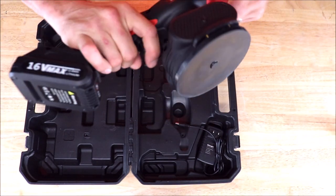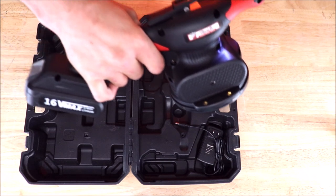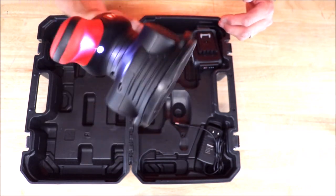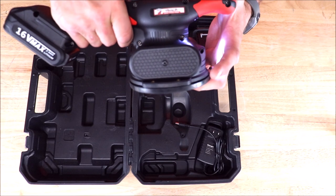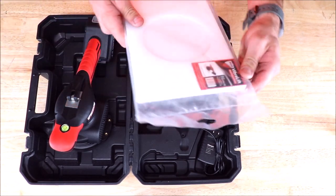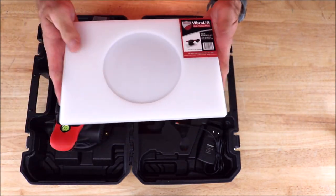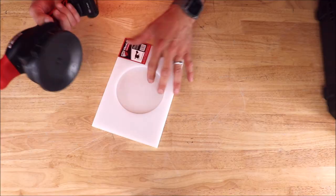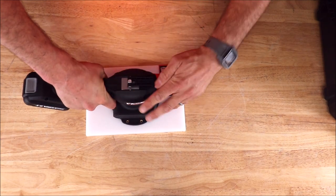Light indicator, and again you can speed the vibration with your trigger, with your finger here. And here is your optional anti-friction plate — genius idea. This helps to transfer the vibration underneath the tile to remove air and helps it slide around. Use the suction to attach — and there you go.